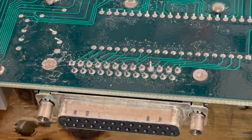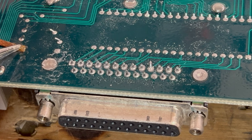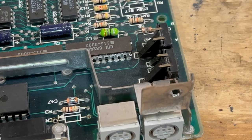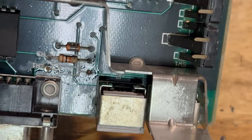We're going to try to remove some solder here and then try to get the rest out with the solder sucker. We might be able to wick it all off with solder wick. We'll put a little flux on it and see if we can get it to cooperate. We got the holes all cleared up, and that stuff is just flux on there.